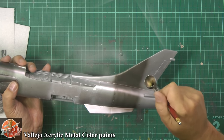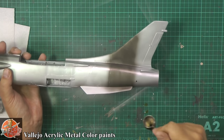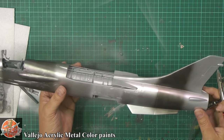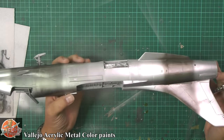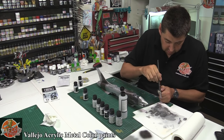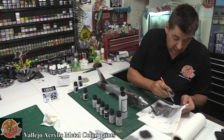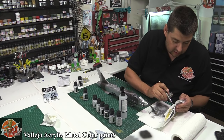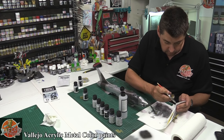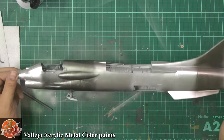We're going to flood the tail as if we've gone totally over the top, just to see if it will level. Now this up here - I'm holding it and it is quite tacky in the hands and I'm getting silver on my hands. It does say about overcoating - allow one hour between overcoats, and then obviously before using the varnish, give it 12 hours. I'm far happier from my point of view to be leaving it an hour between coats rather than doing like we've just done here. But what I do like is this clean out - the clean out is absolutely beautiful on this one.